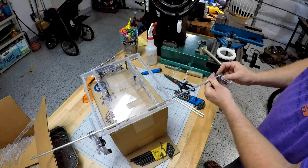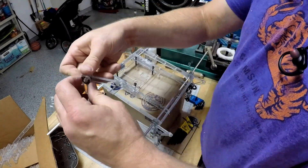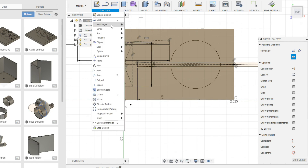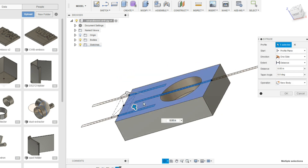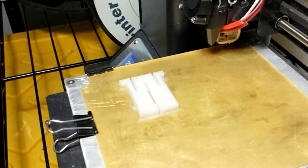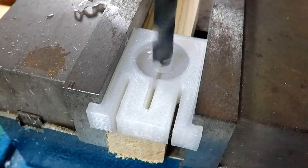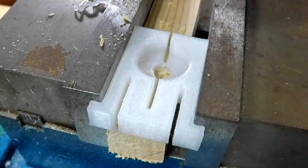Then the legs went on. I had to make sure I didn't put too many on one side without balancing the other, otherwise it would topple over. If you notice me struggling to get them on, some of the spacers were actually too tight on the inner diameter. So instead of fixturing each one individually in my vise, I made a 3D printed jig to keep them all in place. They all just slide in, the sides have a little hitch to keep them in place, and when you align one, you can align all of them - just pop one out and pop the next one in.